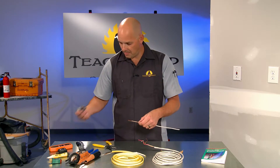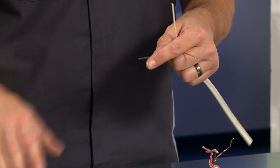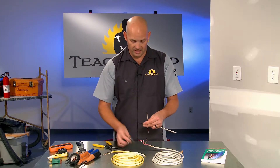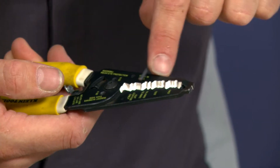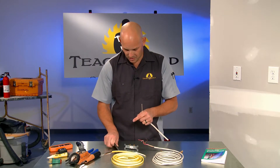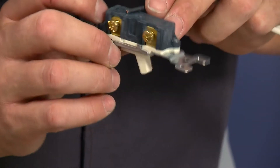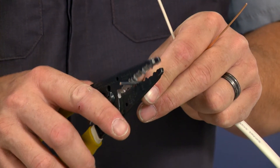Now, if you were wiring a switch like that switch, at this point you would separate your wires coming out of the box. You know your ground is going to go around a ground screw. You know your hot and your neutral are going to go around the appropriate wires. In the case of a switch, your neutral will get pigtailed onto the wire that goes up to the fixture. So it's really just the hot we're using. We're going to pick the place for 14 right there — there's a place for 12 as well — but we're going to put the wire in the 14. There's a measurement on a lot of these; if you can see that, that is how far they want you to strip the wire. It's called the wire strip gauge. With a little bit of practice, you'll get a feel for it.